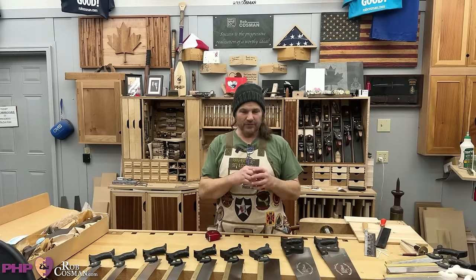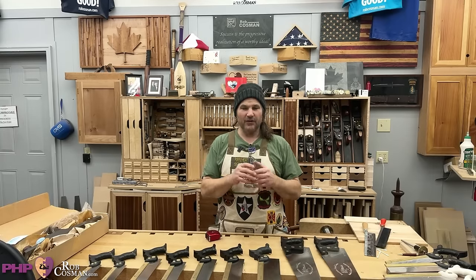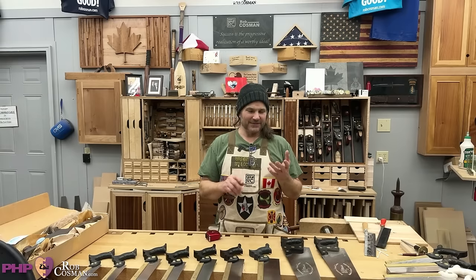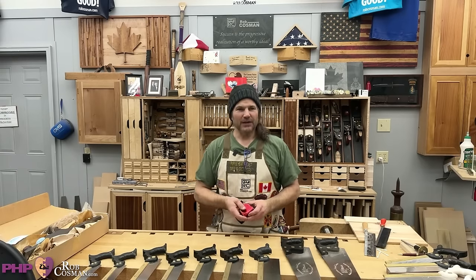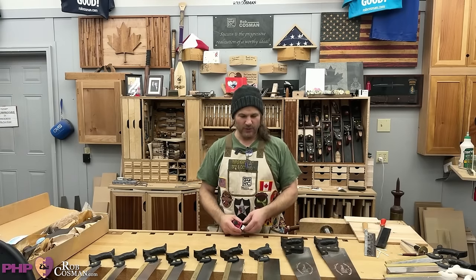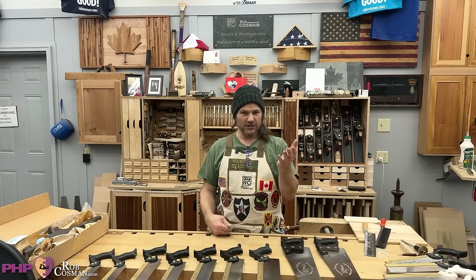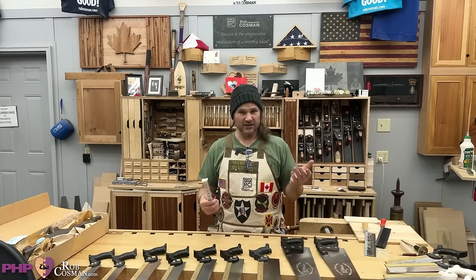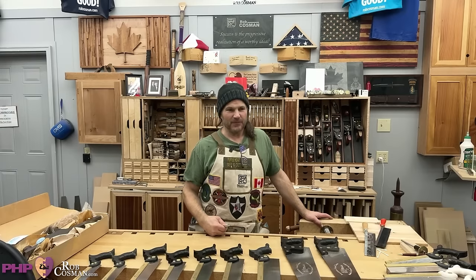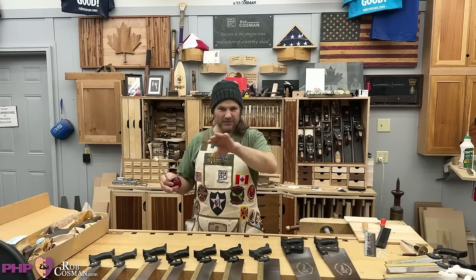So you can go through and take every piece that you're going to use in that project and determine how many board feet. Now, if something is over 1 inch thick, it gets a little bit complicated. I'm going to assume you don't know anything about it at all. When you buy hardwood, you buy it by the quarter. So 4/4 is known as 1 inch. 4/4 rough is designed to yield at least 3/4 finished. We can usually get 7/8 out of it. The wider the board is, the less chance you are going to get that because there'll be some cup.